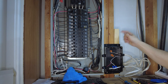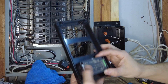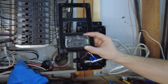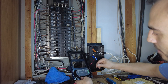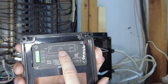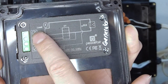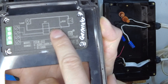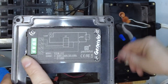I already had some studs here so mounting was easy. Once the box is set up, we'll go ahead and do the generator one first. Make sure you don't have any power going to these wires while plugging them in — if you do, you'll pop or break the meters, they'll trip a breaker inside and won't work anymore. Here are the generator wires — white and black. On the back of the PZEM the top two terminals are for the CT current transformer. It doesn't matter which color goes where as long as they go in the top two. The third terminal is your load-side black wire, and the fourth terminal is your neutral — the white wire.